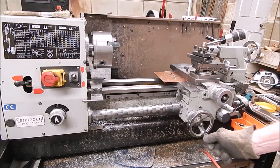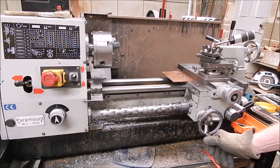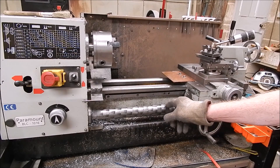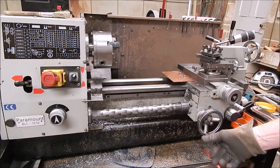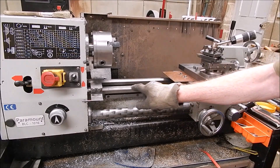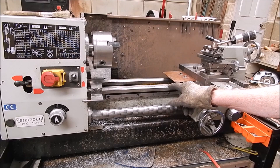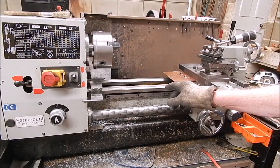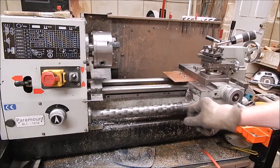Maintenance-wise, there's not a lot to do on these. One of the features it's got are lead screw covers — these things are fantastic. You can see how the black finish is worn off from all the crap that's fallen on them as they compress; it's a sign that the lathe has done a lot of work. The ways are in fantastic condition and all I use is just ordinary car engine oil on them. I believe the best way to look after your ways is to use a light oil — it'll flush the crap off. Way oil on a little lathe is too heavy.